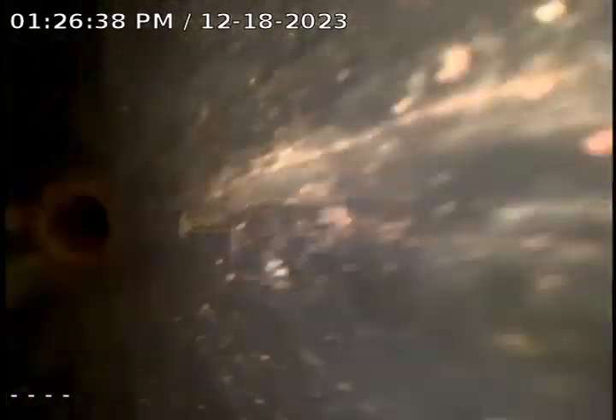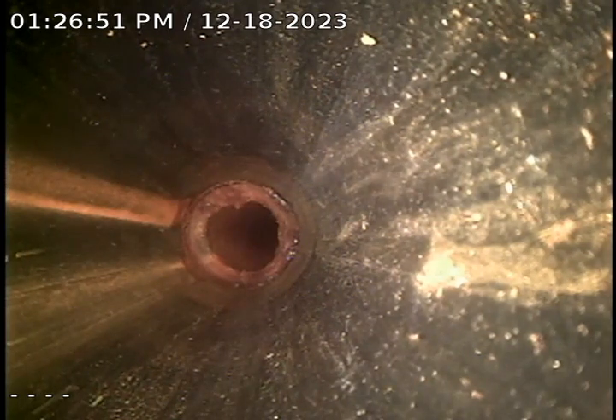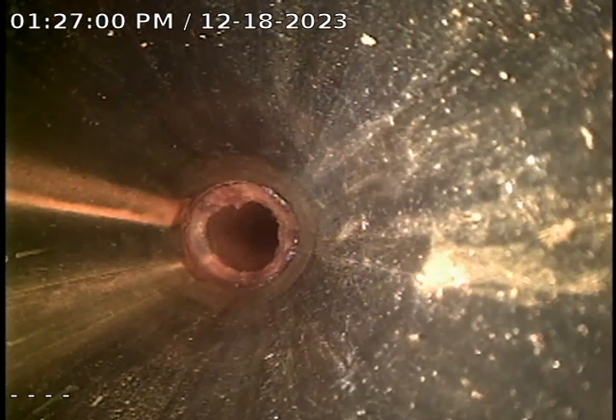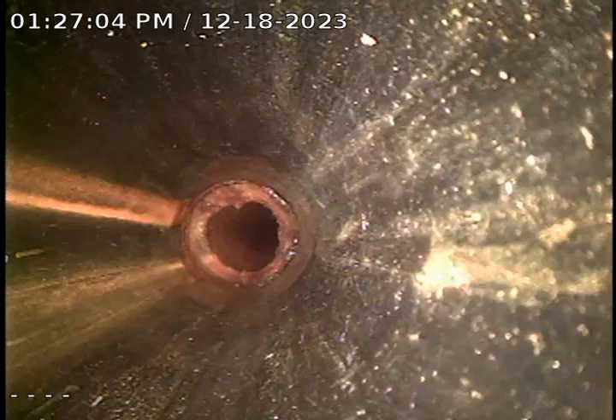And that's the end of the line there. Looks like we're heading up into maybe a vent or a toilet line. So that's going to end our inspection. Main sewer line under the foundation through the yard is ABS pipe. The line running towards the alley transitions to red clay at the tap, and was able to inspect out to the main in the alley. With the exception of a little belly under the foundation, no other issues were noted.